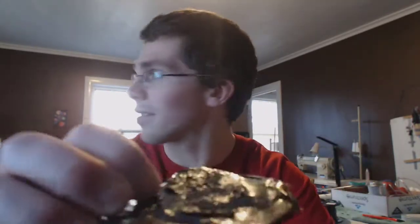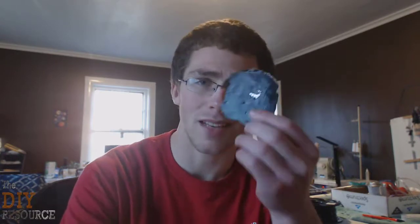It might be a little bit too stiff, but I can't tell if that's just because this side is burned. I've investigated this enough for today. You'll see another upload from me on Monday. I'm going to be doing some more tests — I might do more today but won't record. We'll be looking to improve our PVC mold and try to get something that's not so easy to melt, then experiment with ways to optimize the melt of the TPU. But where we are right now, I would never tell somebody to do this over choosing to use the hot glue pistons. So after this, we'd probably go back to hot glue — we will see though.